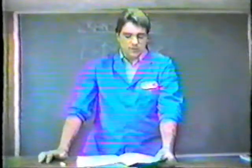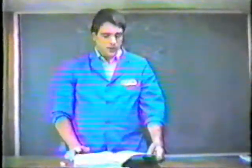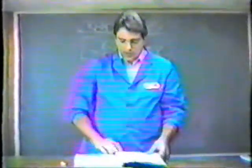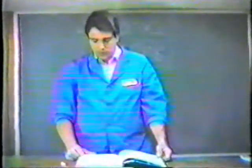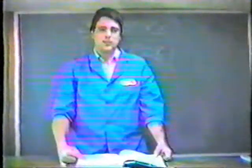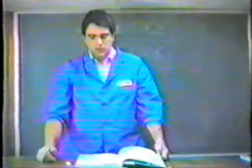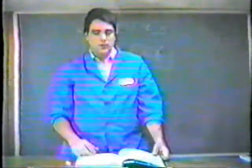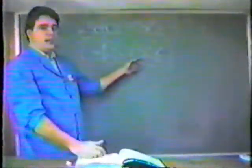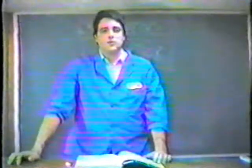Understanding all the shorthand in here will come with time as you use this reference manual. For now, let's look at our basing diagram on page 47. Halfway down on the right-hand side of the page, we have the TO3 case — a standard power output case — which gives the basing configuration and dimensions. So we've come from the number 2SC1308 and found that a GE259 will replace it, so we can purchase a GE259 and we've finished our job.